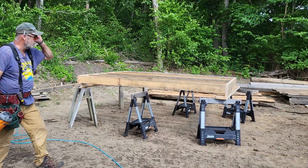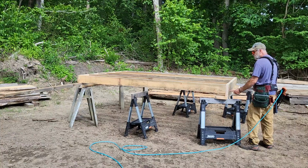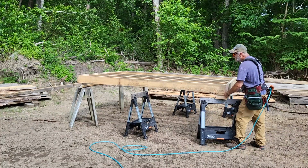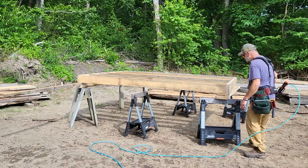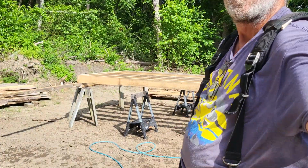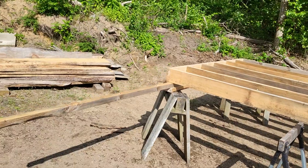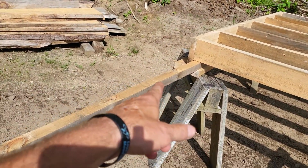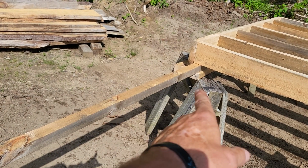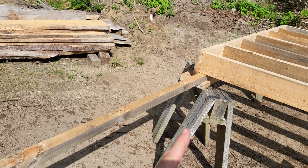And then after I put the edge joist on out here, I will go ahead with a timber lock right through the middle, go all the way through, and then my little 2-inch sill plate is going to be, I'll show you, to keep me from having to use any hangers or anything like that, which, if you ever watch my problem with Simpson hanger video, you should watch it. What I will end up doing is taking that 2-inch piece, and I have tons of them sitting around for offcuts, and run it underneath up tight to the joist, shoot it in, and then shoot up through the bottom into the joist before I cap this whole thing.